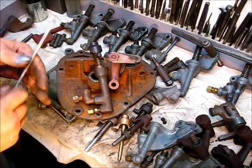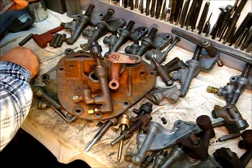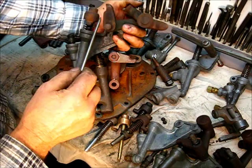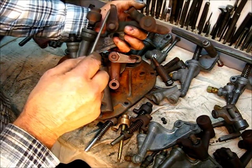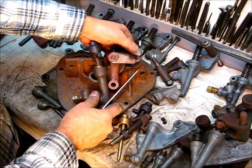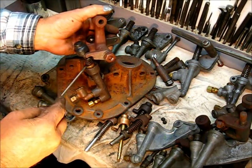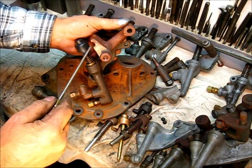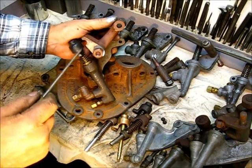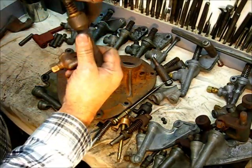See how straight that is — this area right here — it comes up and then it's kind of straight. This one has very little wear; this is a very good one. But this one is worn out. It's already been repaired — it's been brazed up here. You will find this quite often because the plunger seizes up and it breaks. This one will have to be welded up. It's cast iron, so use whatever procedure for welding cast iron you're comfortable with.